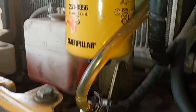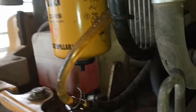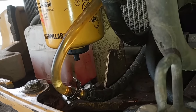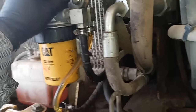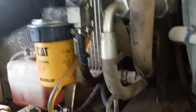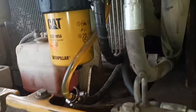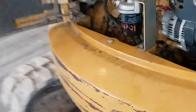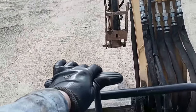I've taken this off and resealed it with a new O-ring — the old O-ring was super old and rock hard. The dipstick tube is no longer super loose. We've got a Cat fuel filter, a new hand priming pump with a nice blond finish, resealed the purge valve, new lock collars. The engine is running now. You might say it's still pulling air — yes, but the RPMs are higher so it appears to be pulling more air, but the bubbles are much smaller. No more really large bubbles. According to Cat, little bubbles are okay. When you prime it now, it doesn't pull in a whole bunch of air. That pretty much fixed it.